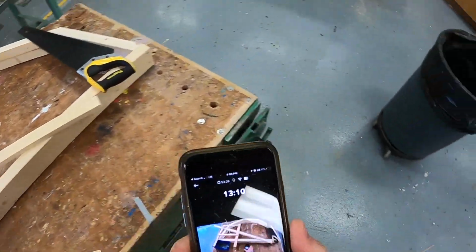You will want to be using the 1-inch ones if your brad gun is low on brads. If you arrive and you're like, I'm not sure if that's enough brads, go to the 1-inch ones, open them up, take a row of them, make sure the pointy end is out. There's a pointy end that is a little bit shiny on your side, and a wider end. The wide end goes back. You line them right at the front, drop them in. That one's a little bit too long, but yeah, pointy end forward all the way at the front. They will fit behind, but that won't actually work. If you load them up like that, it's not going to work. So, front. Get them in place. Line it up. And then you are on to the air compressor.